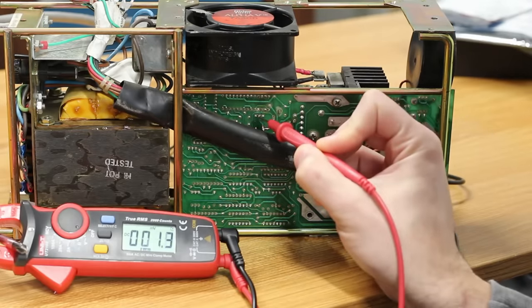The PDP-11/23 plus with 256K of memory is working perfectly. The power supply definitely sent us down a rabbit hole, but we got there — it is working excellently. The only thing still wrong is that one fan I tried to revive; it's just not great, so right now it's unplugged even though it's still in situ. We're going to run it with one fan until I can find a replacement. We do still get an error message about an incorrect jumper setting, and I can see a wire-wrap jumper on the CPU board that has been broken — so maybe that's what it's talking about. I'll need to dig deeper into that, but this is an excellent start for our mobile PDP-11.